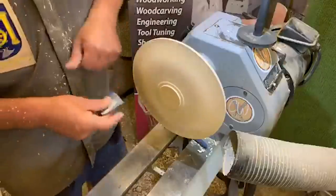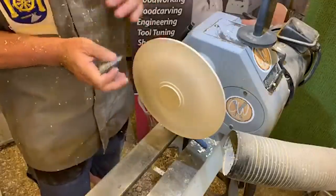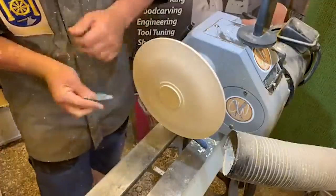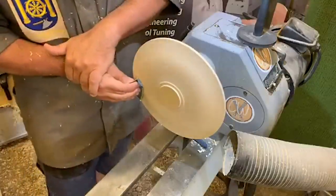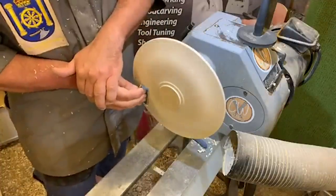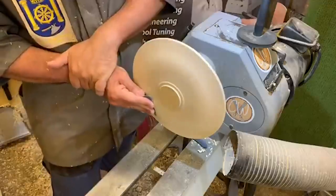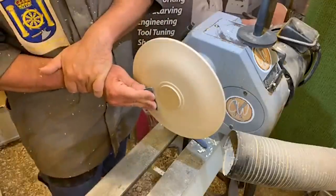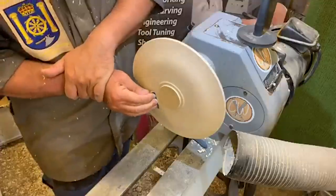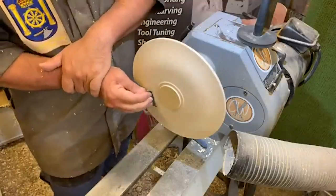What caused the chatter in the example? Obviously vibration, but what caused that? It's the thickness of timber. It's a very thin piece. That's why I was taking it a little bit cautiously. It's ultra dry as well, this one. I'm not making excuses, it's just because it's so thin. You're going to get a little bit of chatter. So nice sharp tools, and alternate your angle of attack, like that shear cut where we were achieving those little angel hair shavings. That's a great one. That needs to be practiced though on smaller pieces, because if you get it slightly wrong, that'll make a massive grab. So do practice that one. Nice sharp tools, facing the flute right into the work.